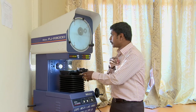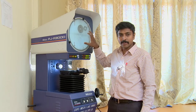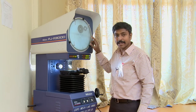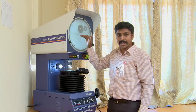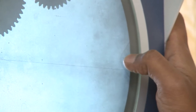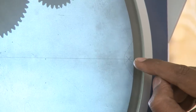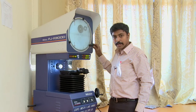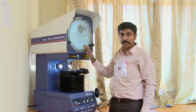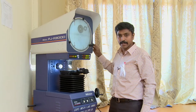Now we will start the measurement. We have a round illuminating measurement table called the projector screen. Before starting the measurement, I have to do the calibration — aligning my x and y axis with a predefined mark given by the manufacturer, which specifies the manufacturer's x-axis aligning point. I use my revolving screw to align my x-axis with this intersection. After you fix it down, do not forget to lock it with the locking screw — otherwise your hand can move it without your knowledge while operating on the screen.